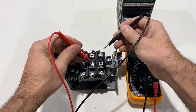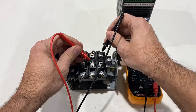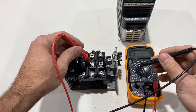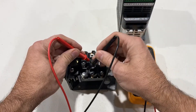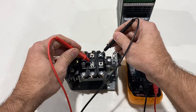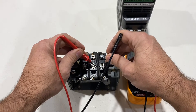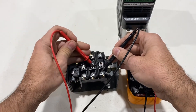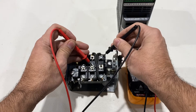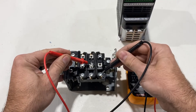Switching to reverse — let's go back to those same two forward wires. If it beeps we're in trouble. It doesn't. So we know we can still use these two for forward and for off. Now in reverse, probe around on the bottom rack — and that's a beep. To confirm: these two beeped on forward, did not beep on off, and this new pair is beeping on reverse. Make sure it does not beep on off — and it doesn't. These three terminals will be the ones we use for our switch: common (indicated by my red lead), forward, and reverse.